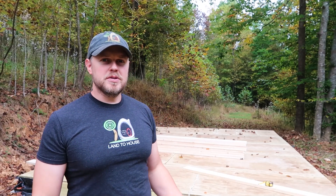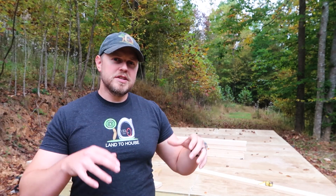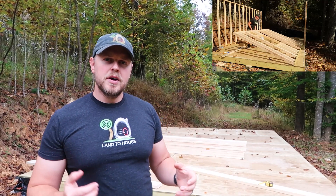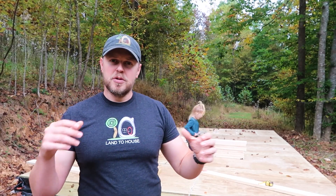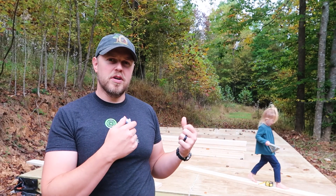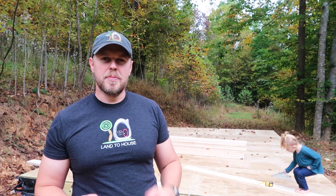Now, if you've never built a shed before, you do the trusses now before the walls go up. So you can use the edge of the building here, the edge of the foundation, as your markers to hold the trusses in place. It works out pretty good.